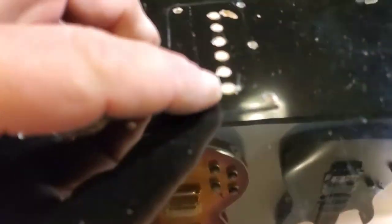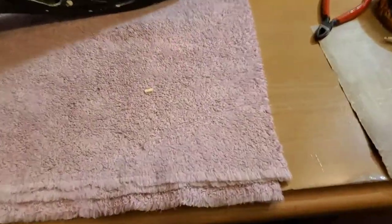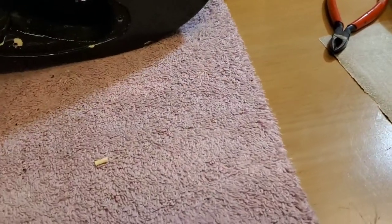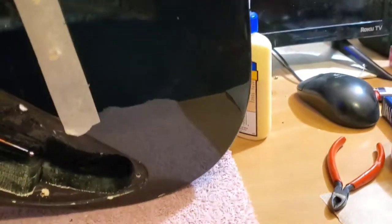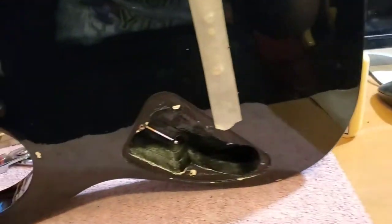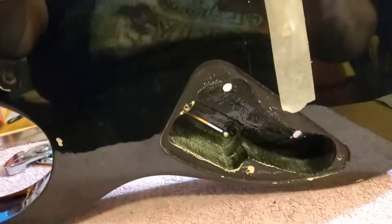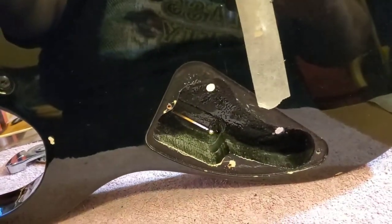Okay, I've already gone ahead and glued... Put glue down in the holes. Sanded down the ends of these so they're flat-ish. Now, I put a piece of tape on the back where that string-through plate was so the glue didn't leak down all over my nice plush work area. So then once that's dry, I will fill that in and sand it all flat. One idea that I had was to maybe put a veneer on the back of this once everything's done, because I'm going to have to hide that, and I'm going to have to hide my cavity once I get that filled in.